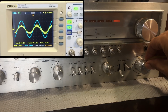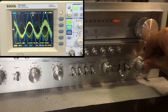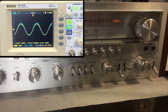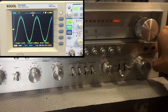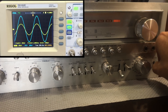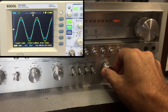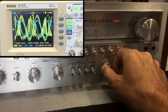If I touch it we can adjust the volume. What we see right off the bat - if I do muting, something strange happens: it goes straight down to the same level and it's supposed to be 20 dB down. And if I just wiggle this, you can see this whole thing is iffy. Now it's normal, or nearly normal - now it's at half level, and if I wiggle it, it comes up again. That slight difference is the balance control - very noisy, as you can see. The balance control actually works but it is noisy as hell.